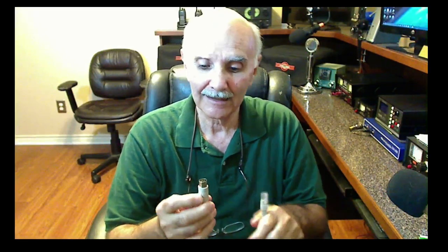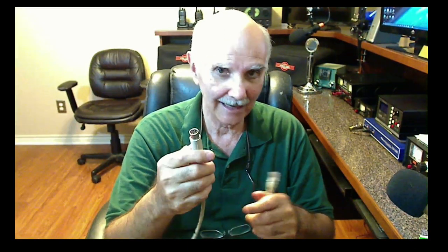All right. On the other side is the radio cable. Now, here's the radio cable that I have, especially for the ICOM 7000 right there. So this plugs into the port in the back of the ICOM designated for data, and this jack plugs in to where it says radio on the back of the Signalink. I've never owned a Rigblaster, so I really can't tell you what connections it has in the back, but I bet you money it's very similar to this.